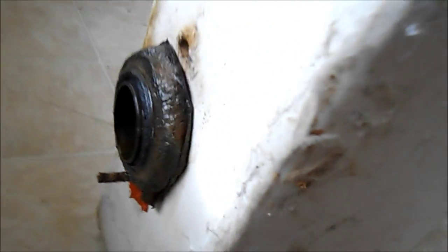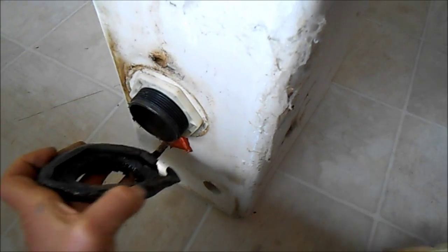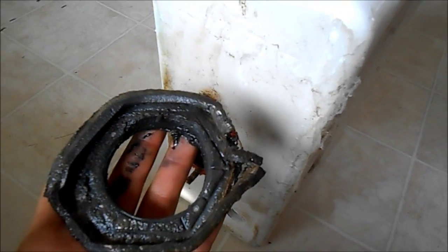This could have been leaking through the seal here — it looks kind of possible. You can see the old seal — that red stuff I tried to stop the leak with — that seal looks pretty wasted. So we got a seal kit here — universal, if there is such a thing. That thing looks pretty far gone. That one's got a new one in it, so I'm going to put that on and take this off and put that whole drain valve in.